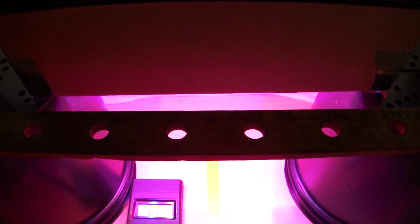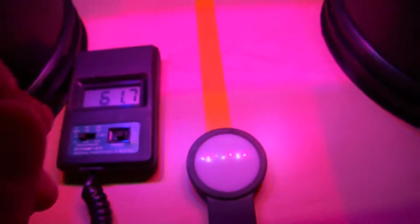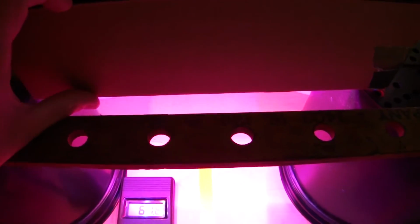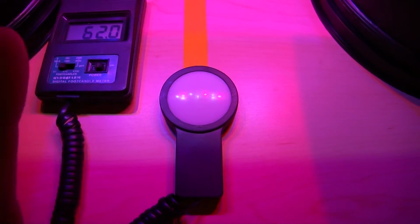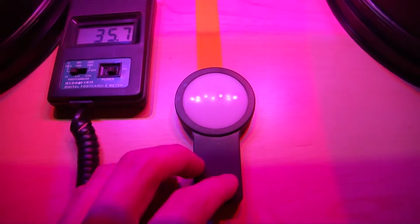We actually use cardboard, and I'll go into how it's reflective on the inside, but right now there's no real reflection going on the inside on the long sides. On the short sides there is, and I'll go into that in a bit, but that goes back to the budget. So under no real reflection on either side of the LED, this is about 3 inches or so of light coming out here, because with an LED they generally emit in a 180-degree pattern, so we would have light loss here, which is just hitting the wall and not doing anything for your plants. This would actually be better than what you would get without anything on the sidewalls, because as much as they're just cardboard, they are acting as somewhat of a reflector.